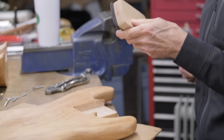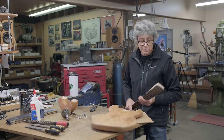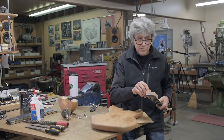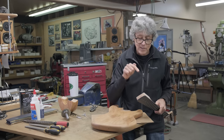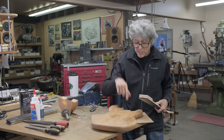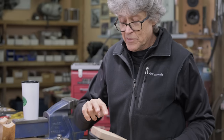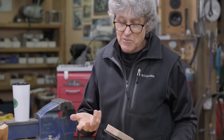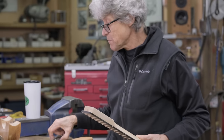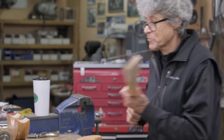That's what I think. In a YouTube video, I think if they were to do this, what they'd do is fill these holes in. You drill it bigger, like 3/8 or something like that, and you put in a hardwood peg, you glue it in, you file it off, and then you just re-drill everything. But these are perfectly good threads. They've never really been used yet. So I want to do it this way. This is my own way of coming up with it. I did not grab this off of YouTube somewhere.